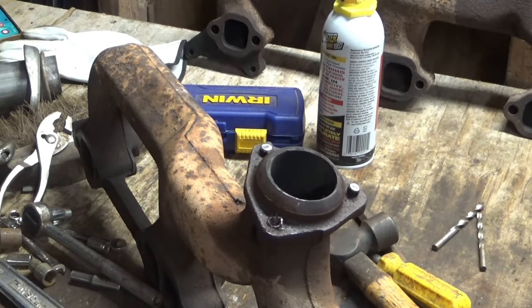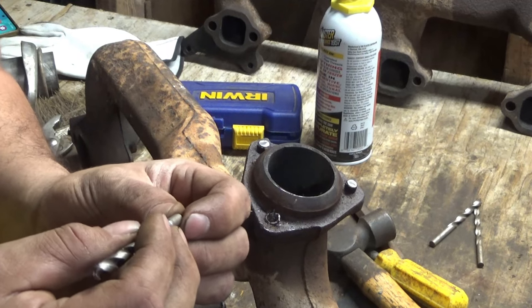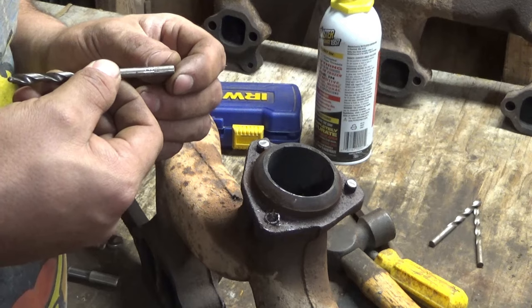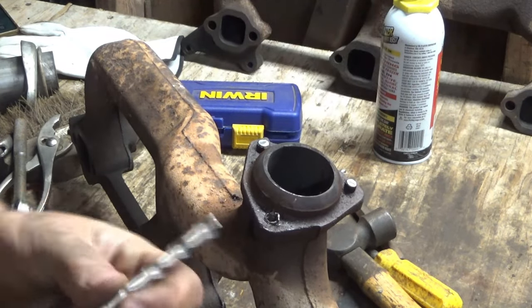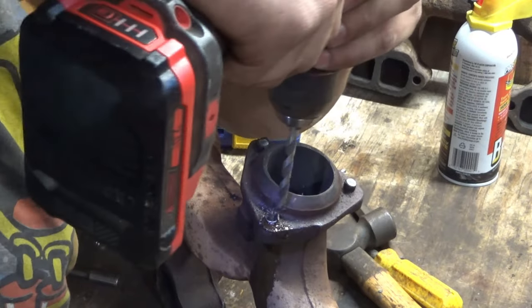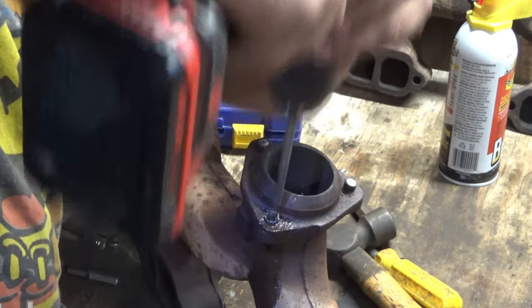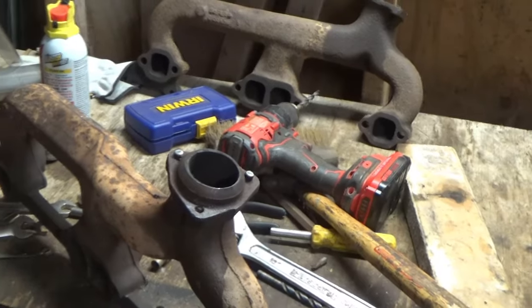Alright, after a few attempts — I mean, I got an okay bite on it with the Allen key. But this drill bit I was using is like 7/32, and 8/32 would be a quarter inch. Okay, we're going to go the quarter inch. Alright, that's not going to open it up very much. That didn't even do nothing. So I went ahead and upped it to a 17/64 drill bit — and watch me destroy this.